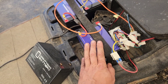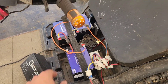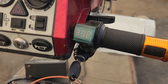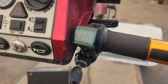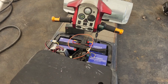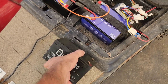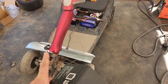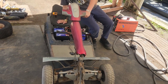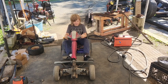A company reached out to us about replacement lithium batteries — LiFePO4 batteries — that are supposed to be interchangeable. We noticed right off the bat when we triggered the ignition it's coming up as 39.2 volts, so this is definitely putting out more voltage than the lead-acid sealed batteries were doing. John's going to take it out for a test drive before we rebuild the front end to be more go-kart-ish.